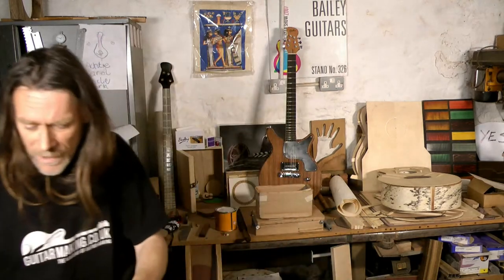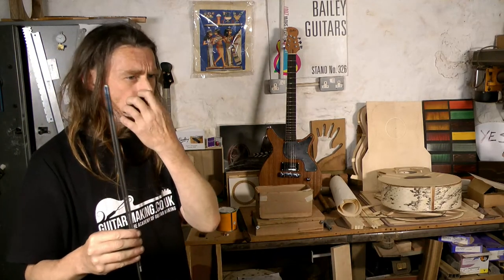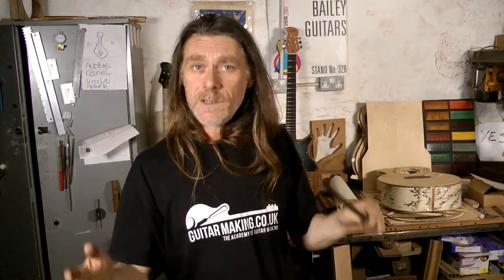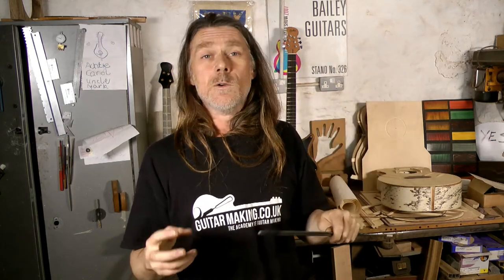Brilliant. So that should be nice and cool now. We've got a couple of questions. Go for it. So DJ's just saying, can you stick it in water or would that make it brittle? Like I said on the last live stream, I'm so glad you guys are here because I meant to say that. Don't quench it in water because that will make it go brittle, because that is how you work harden. That's how you harden metal, is you heat it up and then you quench it fast and it'll go really hard. Now, if it goes hard like that, then it will become brittle and it's much more likely to snap on the end. So we just cool it slowly and then it doesn't become brittle and it's not a problem.